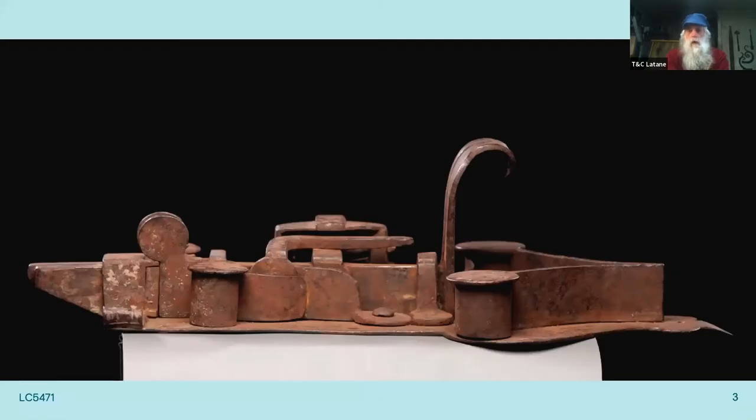This is the view you'd see looking down on the lock from the inside of the door. The bolts are angled so they strike the keeper on the door jamb and are forced back. The tumblers prevent the bolts from moving unless they are open. So closing this door from the inside, one would have to separate the tumblers by hand and push the door closed. The bolts contact the keeper, slide back, and then snap into place. The scrolls standing up high are used by hand to draw the bolt back.